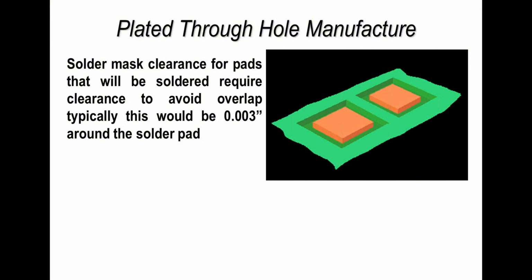So that's typical. You don't really want to see resist on the pads unless they've actually been defined to do that. Now, there is a term that you might hear in the industry, which is resist defined pads. These are used on advanced PCB assemblies sometimes. It allows the copper to be bigger, hence more adhesion to the board, so stronger for rework, etc. And the solder mask is made smaller, and what that then does is control the shape or size of the solder joint. So the resist is in fact over the surface of the copper, but you have to have a good quality PCB manufacturer to accurately do this during the fabrication stage.